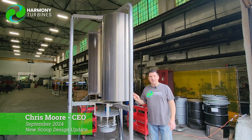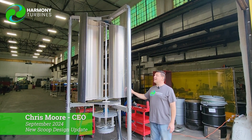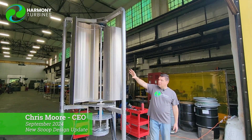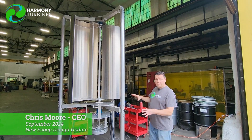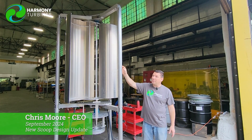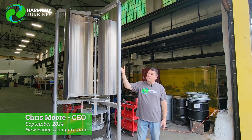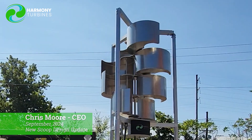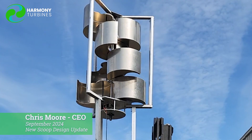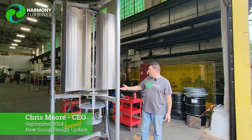When we turn the fan on a little bit later here you're going to see this is really exciting. We're going to be testing this versus the other scoop set, and if the performance on this turns out to be far better then we will start going down this path. That's not to say we would abandon the four scoop design, but we might need to tweak it. I love the helix giving it a nice constant set of torque as it rotates, but if we're getting almost double the efficiency out of this one, you can't argue with the math.